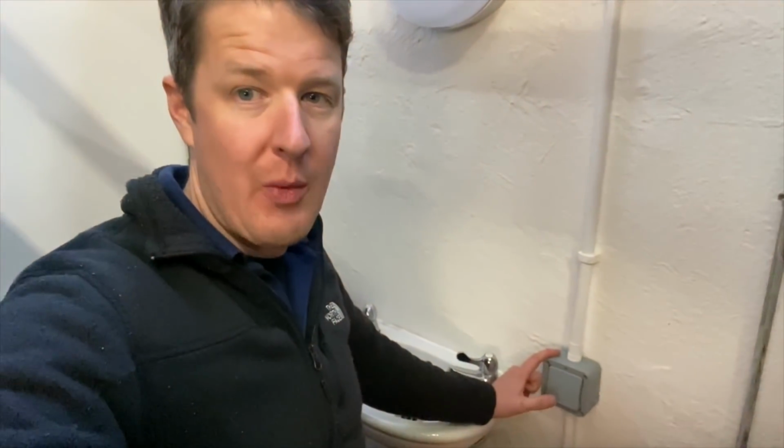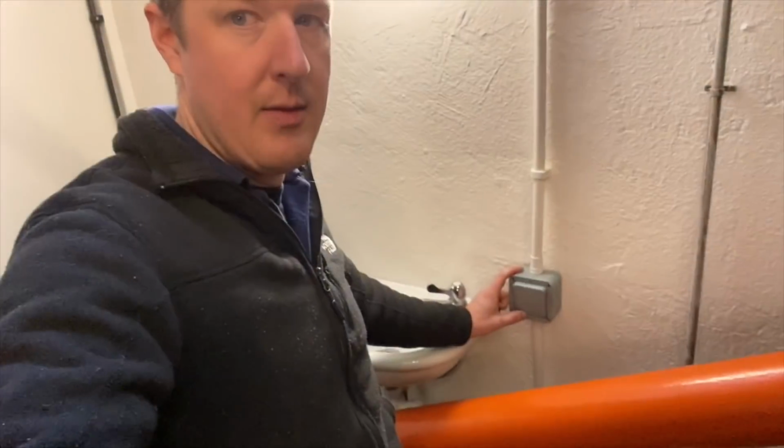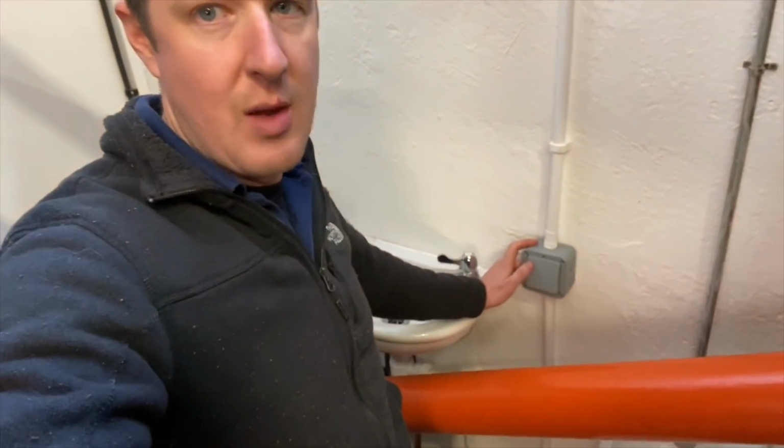I think maybe what was happening was a small amount of current was flowing through to the light through the neon, and because it was an LED light, it was just causing it to flicker every time the driver was sort of charged up or something. So now it just works normally, no issues. So I'm really relieved, because I was worried that I was going to have to try and fit a capacitor or something like that to it. Obviously there's no neon, but that's not the end of the world. At least it's not flickering, it's working as it should do.